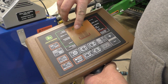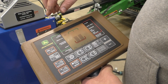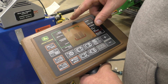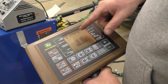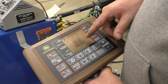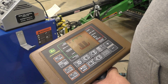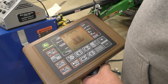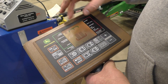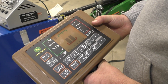Right here is our bale shape. Whenever it's calibrated right, those are going to be in the center and they're going to be even. So as we go up to green, that's good — we want to stay even all the way. If one side goes down to the red, we are severely down on the one side, probably by six to eight inches. So as you're baling down the field, you're just going to be weaving down the row, basically watching those graphs, keeping those nice and even.